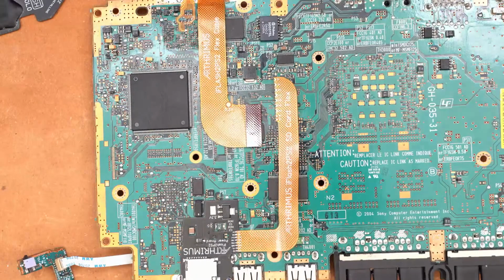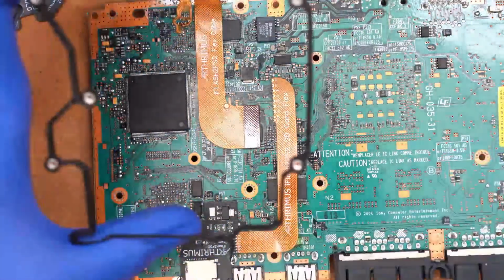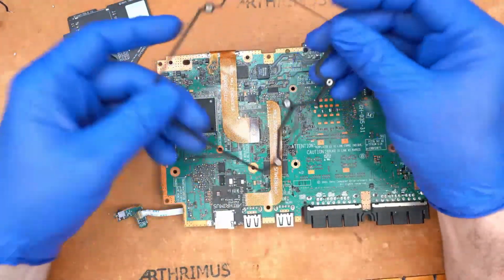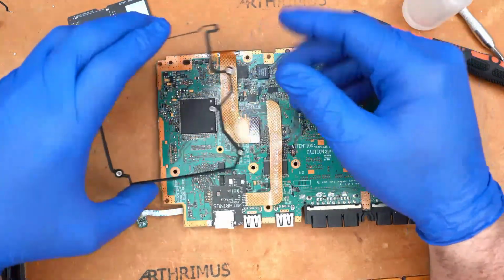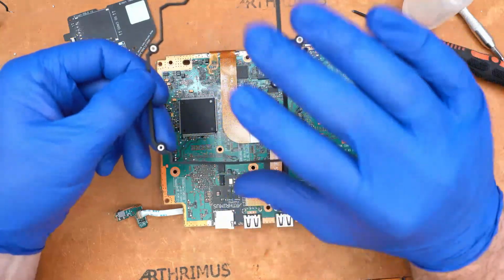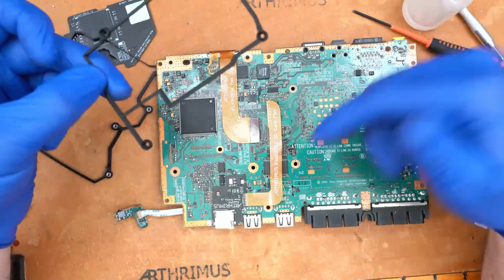All right, so before we solder in the iFlash, we'll go ahead and install the 3D printed frame. Now this frame was designed to completely replace the old bottom shield. On one side you have threaded inserts that align with the screw holes for the heatsink. These align with the screw holes for the drive sled. And this here just lines up the screws for the heatsink.